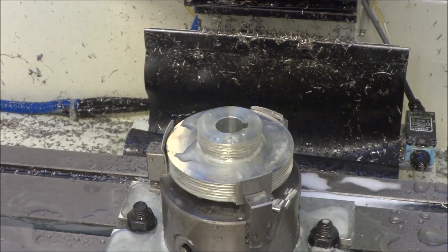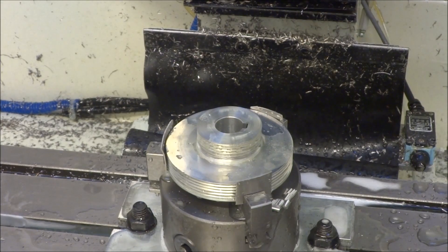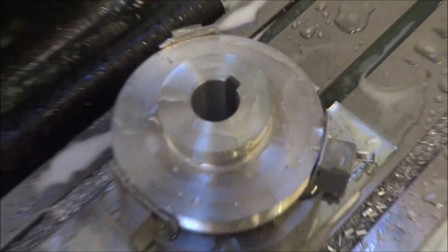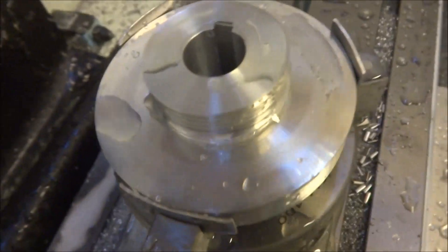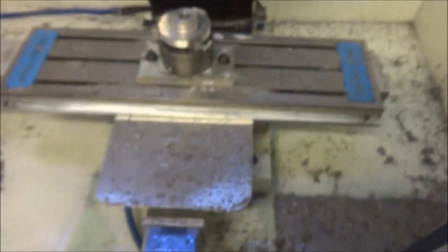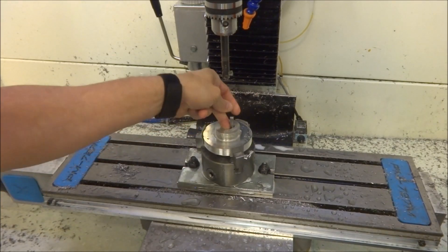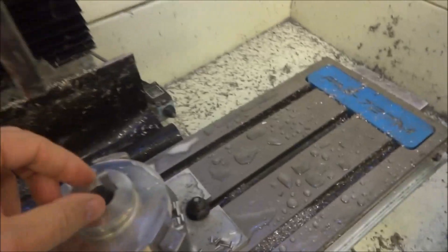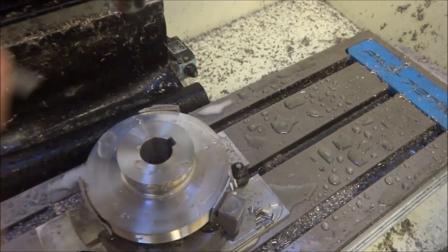There was a little vibration there as you could see, but it's making a really long cut — about 1.6 inches deep. You can zoom out here to see it — about 1.6 inches deep — but a really nice looking keyway there. Let me get the key and check fit. It looks like it fits width-wise. There's probably a little flex, so I think what I'll do is come back and add some more code to do some spring passes to make sure I got the right depth.